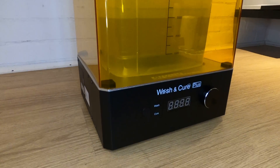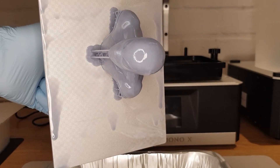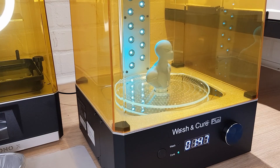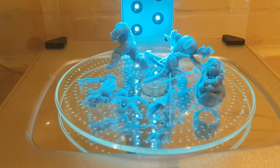Now this all may sound like an unnecessary luxury, but it's actually not the best feature of this machine. This is not just a wash machine but a wash and cure machine. When your parts finish printing, they're not actually 100% fully cured — to fully cure your part it needs to be bathed in UV light for a little while longer. You could sit it out in the sun, but when you lift off the wash tank and add a small turntable you're ready to final cure your 3D printed part in front of a number of UV lights. These provide plenty of light to fully cure your part in just a couple of minutes.